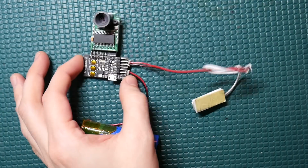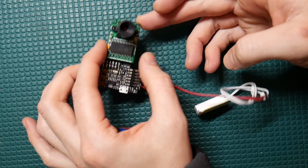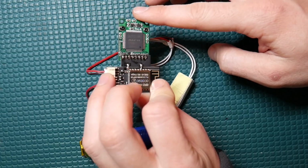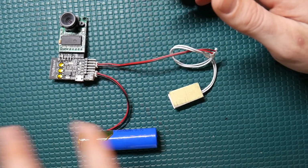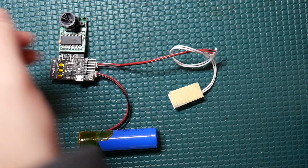So what we have here though is one of the trigBoards. We have an interface board and an off-the-shelf ArduCam, I think that's how you pronounce it. And this is the 2 megapixel ArduCam Mini. So that is interfaced up with the ESP8266. And by the way, it all runs off of a battery. Right now it's sleeping, just sitting here, pulling less than 1 microamp.